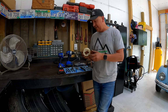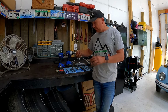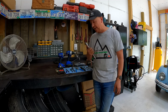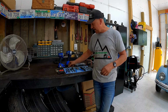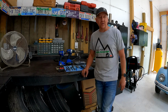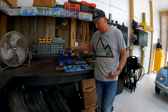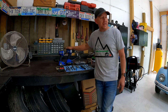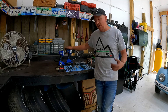This is what's left of my old fan, and I was able to get this 1/4 inch drive ratchet up in there and have enough room to move to get those loose. Because I couldn't find my 3/8 drive 12mm socket for some reason, I used the 1/4 inch drive and converted it to do this. But you'll need a 12mm socket, some extensions, and a little bit of plastic to shove in there to hold your bolt in place. Now guys, I want to give credit where credit is due. This method for drilling the hole up top and the little trick with the plastic in the socket, I learned from Tyler Koehn's video, and he has a great video on this process. So if you're preparing yourself to do it and you haven't seen his, go over and watch his too.